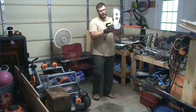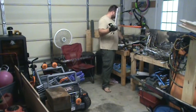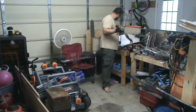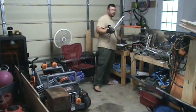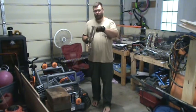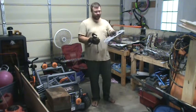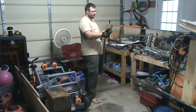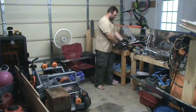Turns out that these flanges aren't supposed to get dimpled in this step. Both of the F1012 bulkheads, that's supposed to occur on the next page on step 4. But I'm going to go ahead and, since I already dimpled one, I'll dimple the other. Just got to make sure these single hole tabs up here that are under the longerons don't get dimpled because the longeron is countersunk. But other than that, there's no harm in dimpling them now.